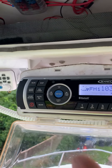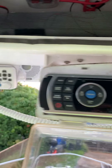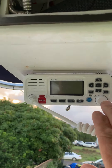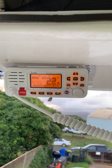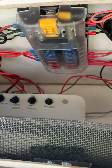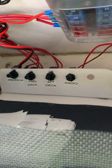There's the radio — it's an older Jensen. I'm not going to turn it way up; that's about a third or so. It's got two speakers in the electronics box. Our new ICOM VHF radio. I did do the DSC number for emergencies. It has a GPS built in. There is a positive and negative electrical box here. They all terminate back-aft. There are some light switches here: the anchor light on the T-top, the forward deck, aft deck, and the radio itself.